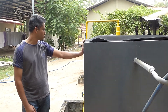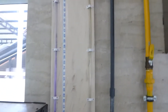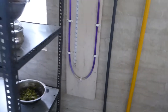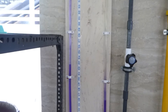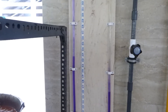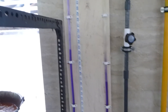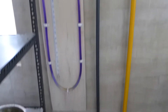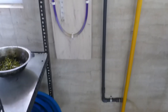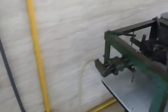This is the inside of the biogas line coming in. You can see this is the manometer, which actually shows the pressure — it won't show exactly how much pressure, but it will indicate there is a buildup of gas so we can start using it. The yellow pipe you see is for the LP gas, and the PVC pipe is the one that comes from the biogas plant.